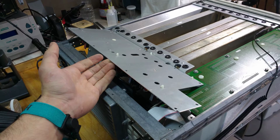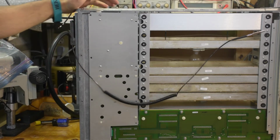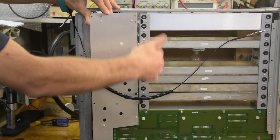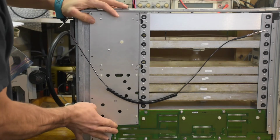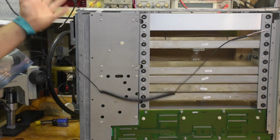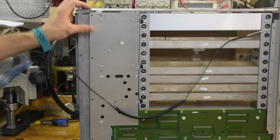Oh well, actually, I had to interrupt that test when I noticed the unmistakable smell of burning components. I didn't notice any magic smoke coming from anywhere. I thought it probably came from the power supply section, which is mounted to a plate on the bottom rear of the unit. And there's a board on the other side of this, plus another smaller board about the size of the hand here, and I can sort of start tipping it out here, but the PCB is getting stuck on a few mounting tabs, and there's a heatsink that just won't really cooperate. So I'll have to work on this a bit more and find out. I hope I don't have to take out the whole rear section, because it's a lot of screws holding it in there, and I'm afraid, well, the frame's probably stiff enough not to collapse, but still, if I can avoid that, I will.